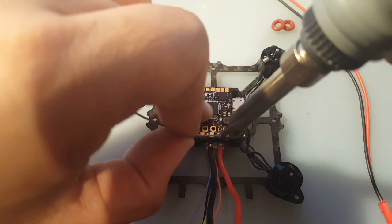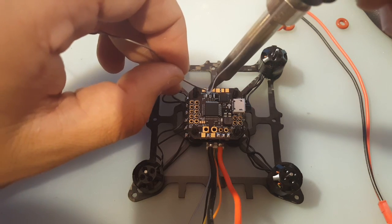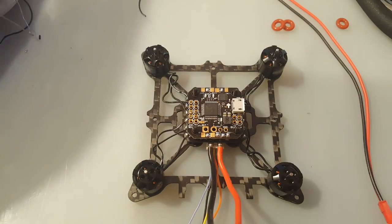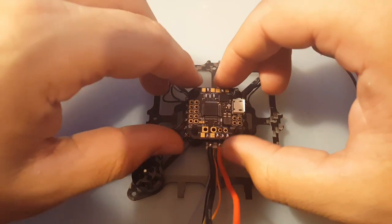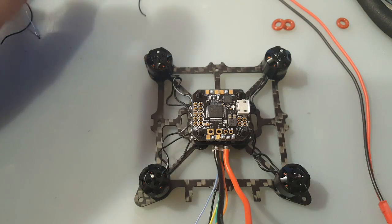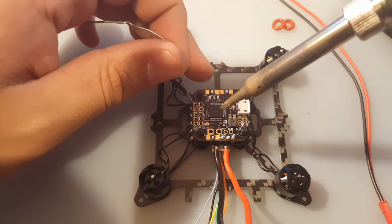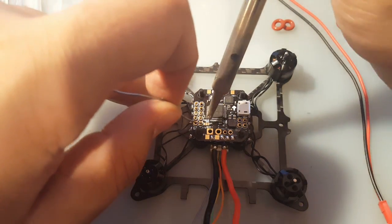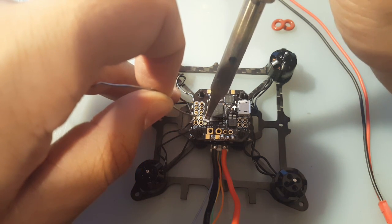These are going to be for the ESC signals. And there we go. Here we're done. So, and let's bridge S-Bus. S-Bus is going to be the 2 on the right side. Now this is going to be very difficult, so be careful when you're doing it, because they put a capacitor right next to you. Right freaking next to you. Unbelievable.